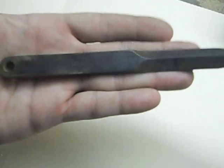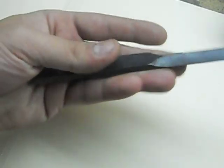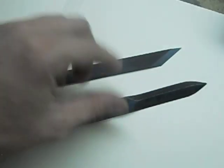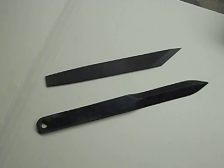I actually kind of like that result, because once I coated it in clear lacquer it sealed everything in and gave it an antique look. So those are two chemical ways: gun blue and black oxide. Black oxide you can buy online or at a tool and die supply store. Gun blue you can buy online or at gun stores — it's fairly cheap, while black oxide is a little more expensive. I'm lucky to live in Michigan just north of Detroit where there are a lot of industrial suppliers, but you can find them.